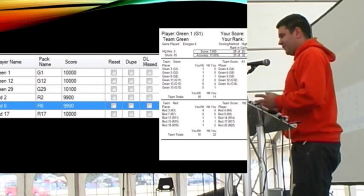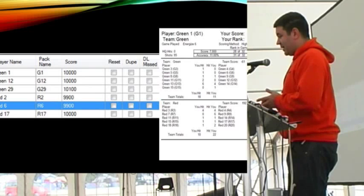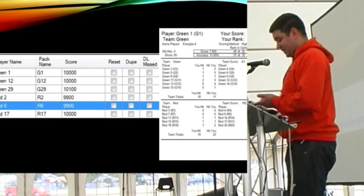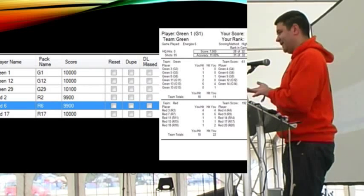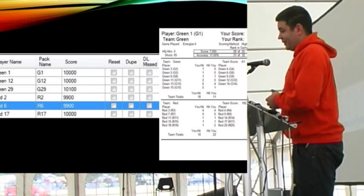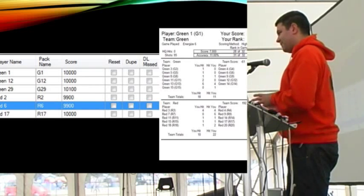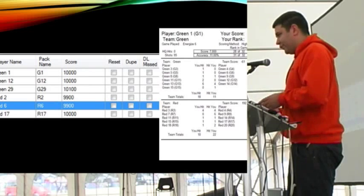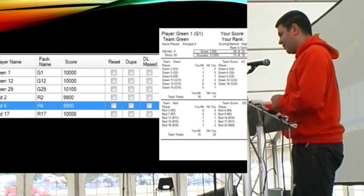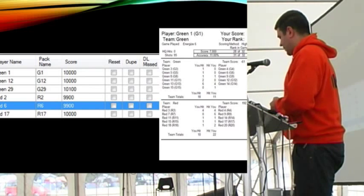The data format is very simple. You've got one byte indicating the packet type, followed by one byte which in the case of a shot signal is your gun ID, followed by the one's complement - all the bits are flipped on the third byte compared to the second. That is a shot signal, and the good shot signal is exactly the same with a different message type. The gun download and game settings use CRC-16s because there's more data and you can't do the one's complement.